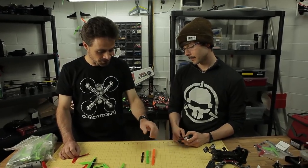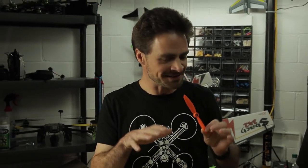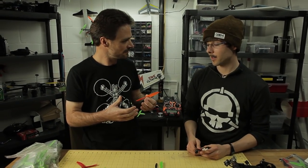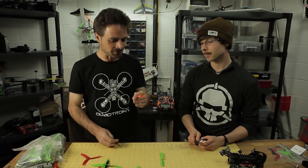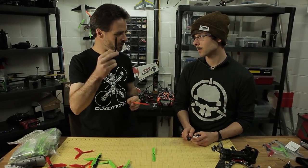Chad, why do you use 5 inch props? Well, I use the 5 inch prop simply because I've used a 6 inch prop before and I didn't like the response. It felt a little bit less snappy, a little bit more doughy. When you put a big motor on there and a big battery, you had more power and possibly some more speed, but I lost the response. You use the analogy of an American muscle car for a 6 inch prop quad, and as you go smaller, you get more towards that go-kart level.